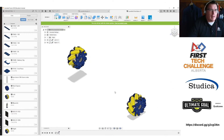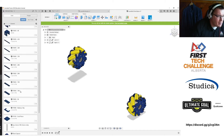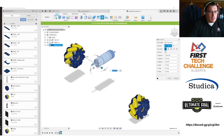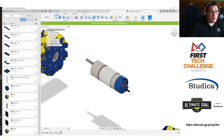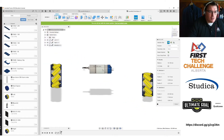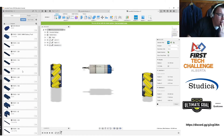I've got a couple of wheels — they're not aligned, but that's okay. I'm going to grab my channel, because this is going to determine the width. I believe that's a 288-millimeter channel. But first I've got to grab my motors and just make sure they'll fit. Part of why you're CADing and designing this way is to figure out the geometry. I can see this motor is going to stick into this wheel, but when I click Inspect, the motor is about 132 millimeters long — meaning two motors are 264 millimeters total — so I might want to use the 336-millimeter beam instead.